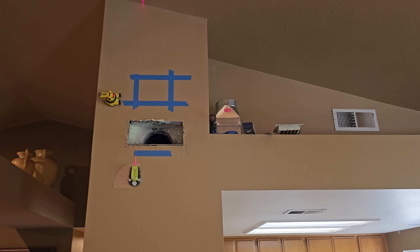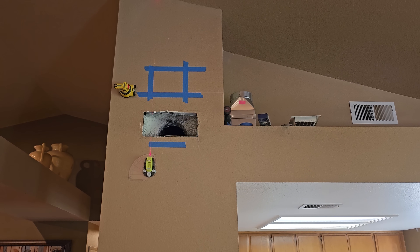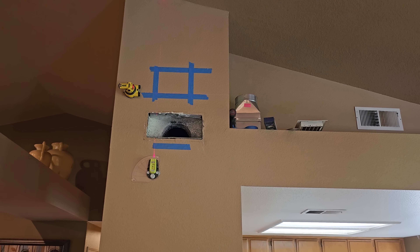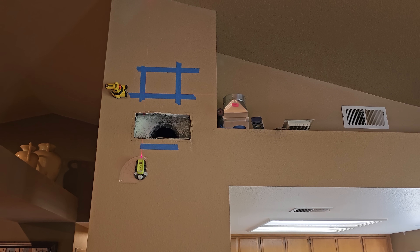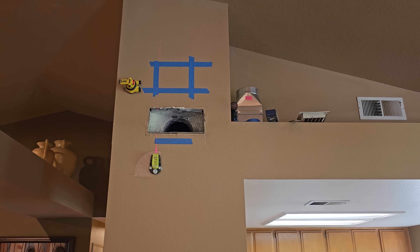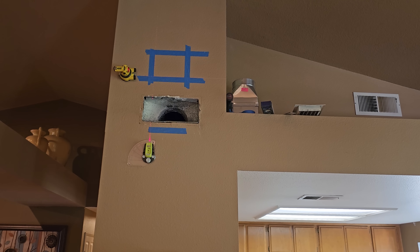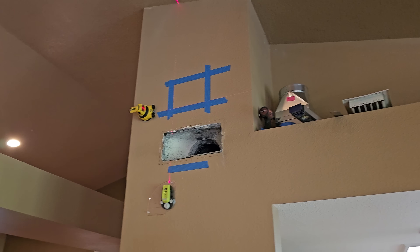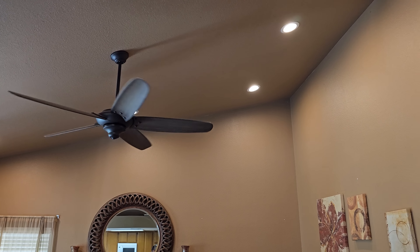I know I'm a nut, but I get obsessed about perfection, and I realize it's not going to be absolutely perfect. I'm squaring out some new boots because we're going with smaller boots and registers to get proper throw for the two-ton system we're installing. So I squared up the new hole. I decided to take out the old boot and just patch over that rather than trying to patch half of that boot. So I've got the new hole marked out. We're going with smaller boots and registers to get proper throw across the house so we get proper mixing.